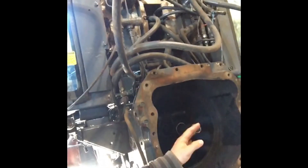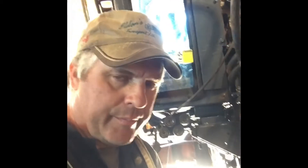I'm in the process of removing a cover in there, but I can't remove that cover without taking that shaft out. That shaft that's horizontal up there — I've got to take out this body mount so the shaft will come out. Then I'll see if I can find any seals that are leaking back there. We're gonna find a fix and get her back operational. I've got a clutch on order — if you disassemble a tractor and go all the way in like this, you might as well replace the biggest wear part, which is the clutch on a manual transmission tractor.